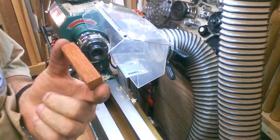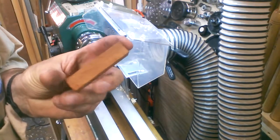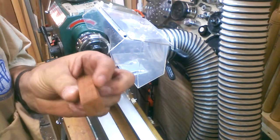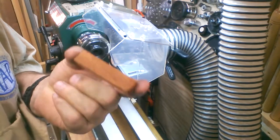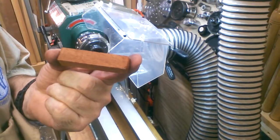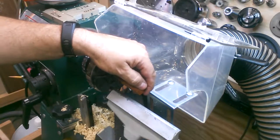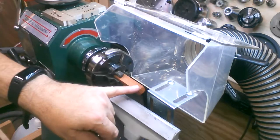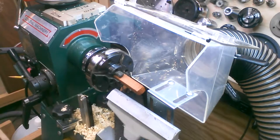I found a little piece of pen blank off-cut — I believe this is a piece of padauk, so we'll use this on another project, but this one's going to become the finial for that cup. I'm going to start by shaping the tip of the finial, and then I'm going to move toward the base, and ultimately sand it up, finish it and part it off.